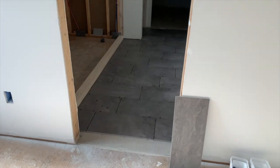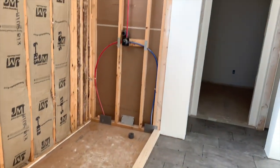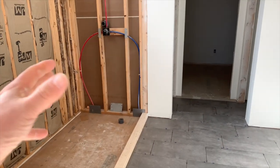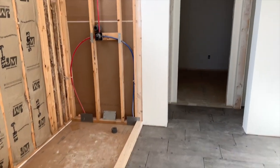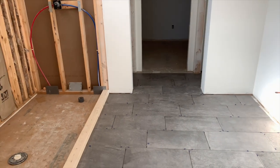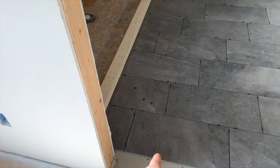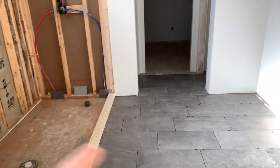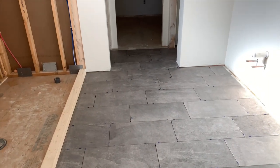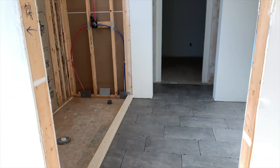But this tile is very heavy. This shower floor is very heavy, and there's gonna be solid glass right here — three-eighths, maybe half-inch. That'll probably be another five, six, seven hundred pounds of glass. There's gonna be a lot of weight. So we're wanting to go under the floor, dig a footer, and put a beam in, and support this floor about right through here to half the span load on these two-by-tens so we won't get any flex in this bathroom.